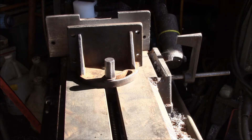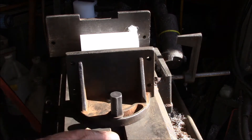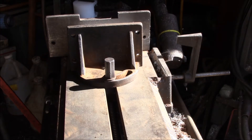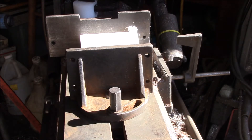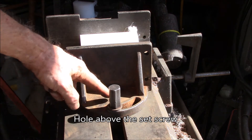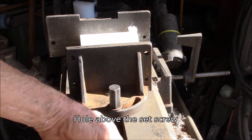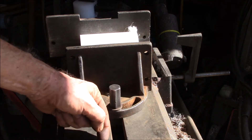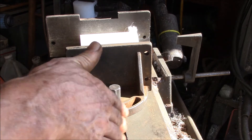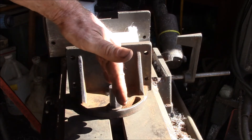It's a pretty intricate little mechanism that actually works quite well — you just have to clean those threads out every couple of years. It's a real time saver because you can just pull the jaw back, slide it up, lock it tight, then break it loose and pull it back without having to crank it out. You do have to get it together the right way because it'll go together several ways but only works right in one position: the hole has to be offset to the hand wheel side, and the pin on the half nut has to be on the hand wheel side facing down. The half nut is loose on the bottom and just swings back and forth until it hits something.